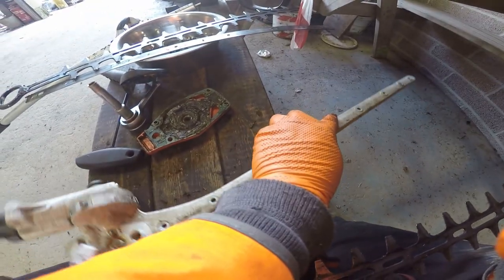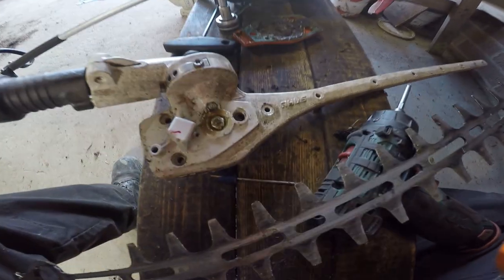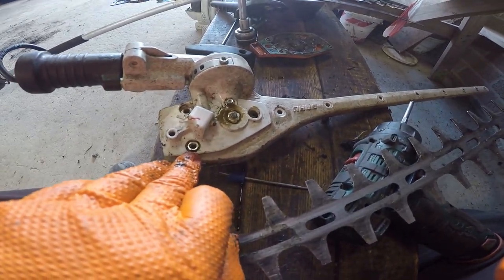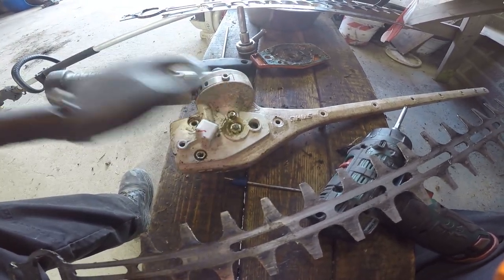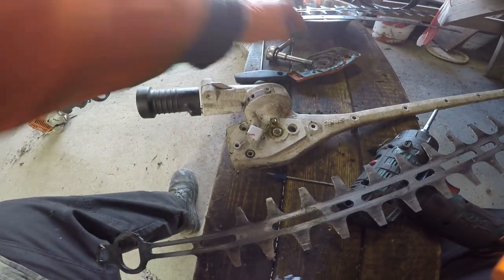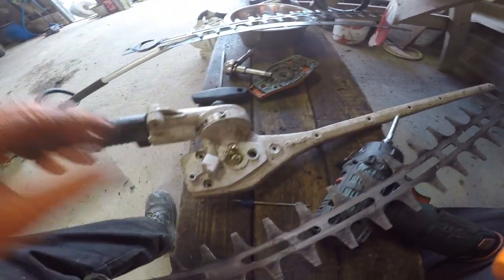We'll take a chance and turn it over and show you that these three that we just took out from the gearbox all have recessed nuts in them. So you need a special socket because the clearance is very, very reduced. And this is why you have to take this piece off, because these two on the back are otherwise hidden. That's a modified socket. You can, I think, buy a special tool for them still. But modifying the cheap socket is more cost effective.